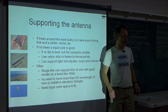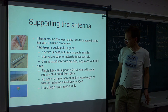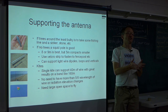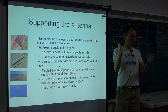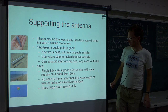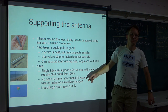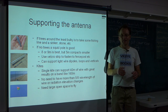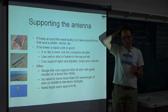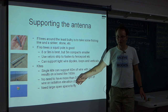Another possibility is kite antennas, and I've had some incredible results on 160 metres AM. You can use different kites — I like something like a box delta kite. If you have a kite antenna you can basically set up a station as good as people with big towers. You're vertically polarised on a band like 160 metres and can get some great results. The longest I've had a kite up continuously without attention has been 40 to 50 minutes — generally it's better if you've got two people: one for radio contacts and one to look after the kite.